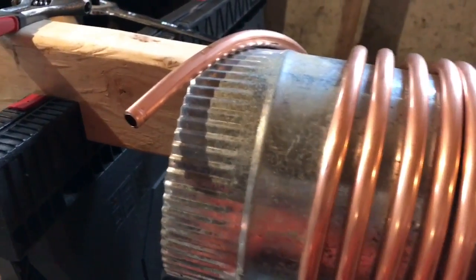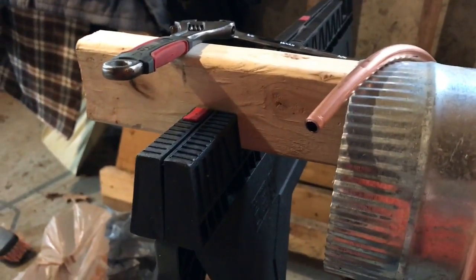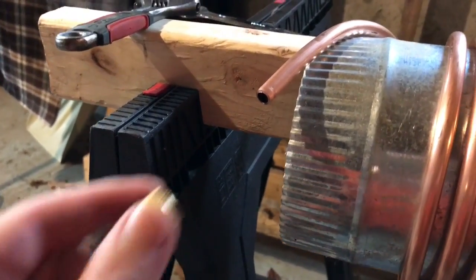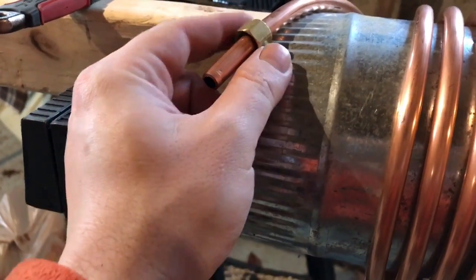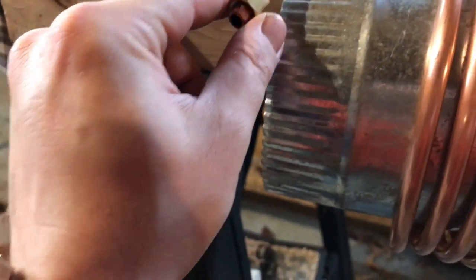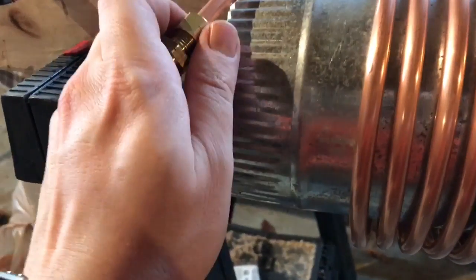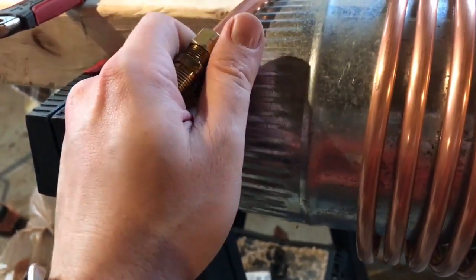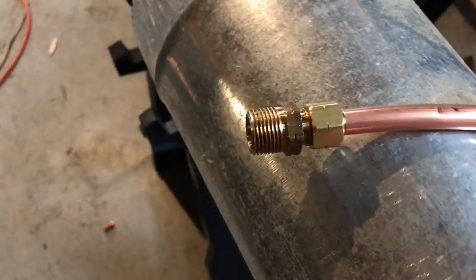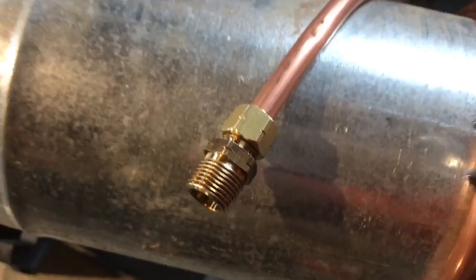You can see I've taken off the clamp I had holding it down — it's pretty tight. What we need to do now is put the compression fitting on so we can slide in the other attachments: the feed line and the ball valve where it runs out. These compression nuts are interesting — they already have the compression sleeve built in. We just take the nut piece and attach it to the other valve, then tighten. I'll get it on there finger tight — from what I understand, you get these finger tight and then turn it one half turn to lock it into place.